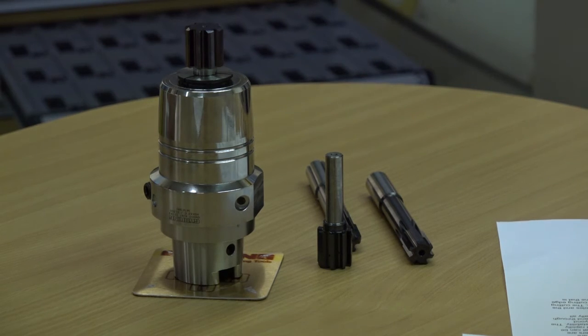In a reasonable construction steel you can run up to 250 metres a minute. With a reamer that has eight teeth and you're running at 0.1mm per tooth, you're getting almost a millimetre per revolution. The actual speed it achieves is absolutely dramatic, and that cycle time saving is the biggest benefit of the tool itself.